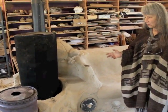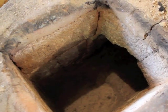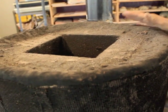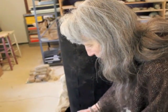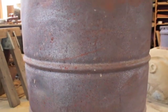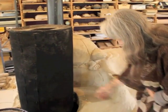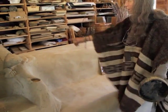This is a rocket mass heater — we're using the same combustion unit seen outside. Inside is that brick J-shaped tunnel going up, and you can see the bricks up here. Around the brick chimney we've done insulation in a metal cage with perlite, clay, and water to insulate the heat riser. Here's our barrel for protecting the fire if needed — it's optional depending on how the fire is running. Over this goes our 50-gallon steel drum. You can see how the gases come down around the barrel and into an area confined down to an 8-inch pipe that runs through the bench and out of the building.